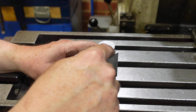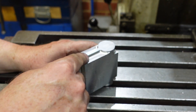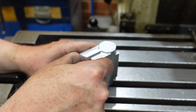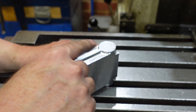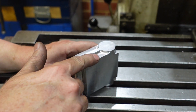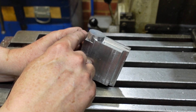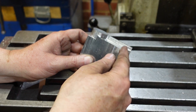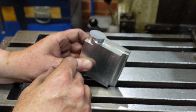Here's my clevis blank after I've used the Volstro head to put the round on there. I had a ball nose cutter in there and that's nicely put a fillet in there, then I've stepped out a little bit and come in with a straight cutter. I need to do a little bit of filing and smoothing on this. Same thing on the other end but deeper, and I'll round off some corners — there's a few little burrs where I haven't quite cleaned up.